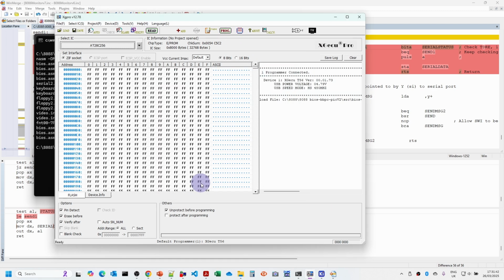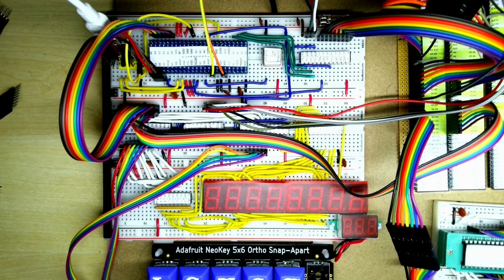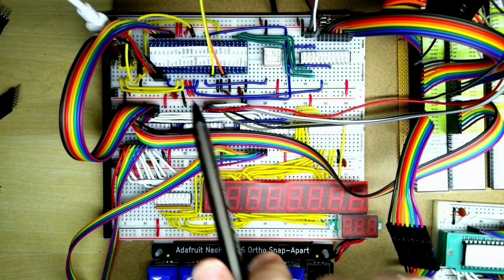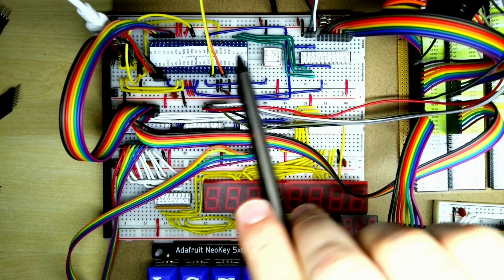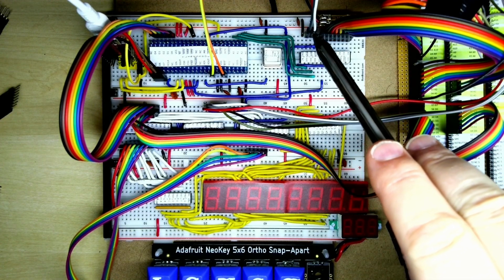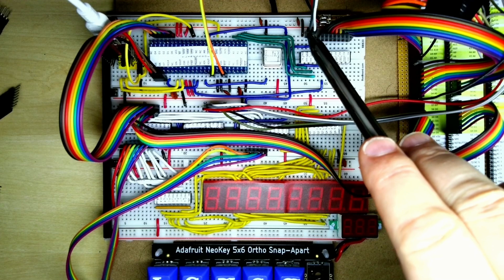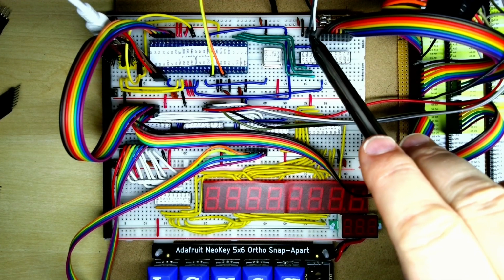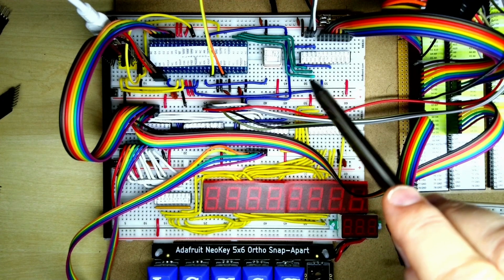We'll put that back into the computer. Okay, so here we have the UART. This is our surface mount chip on the 48-pin DIP adapter. The 2 extra lines here are the chip selects for the IO0XX range and the IO3XX range. I've missed out those. I have also added 2 extra links in here.